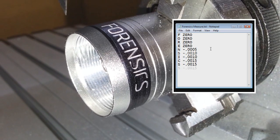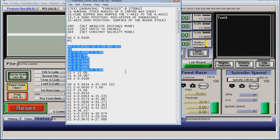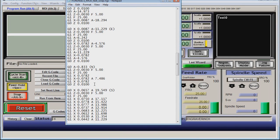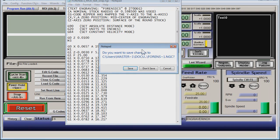I say rerun these, moving down a thousandth. Let's do some editing. We only need to run the last four letters. The quick and clean way to accomplish this edit — just delete it. We're running in absolute mode so this method is pretty painless. We go up in Z, spindle on, go to location, then optional stop before the plunge. Save it and good to go.